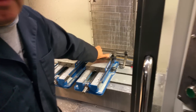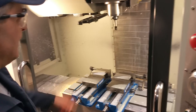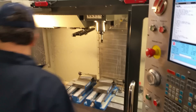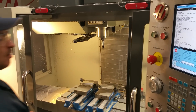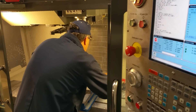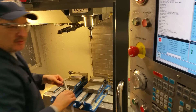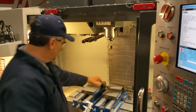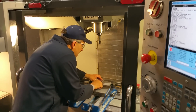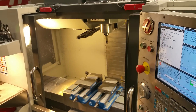As I might have expected, this is a little chewed here, but a lot of that's to do with the vibration — that cutter is sticking out a mile if you ask me. Just going to throw a quick check on here. Lots are within two thousandths of size on the length and width, so it cut to size very well.